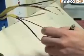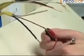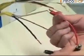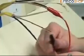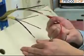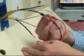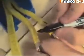Now we will go to the other end of those three cables. We will connect the red and black lead of the remote indicator light to the ground wires until it flashes. If it flashes red, we will reverse the connections. Once the light is flashing green, we will mark the cable connected to the red lead number 1, and we will mark this cable number 2.